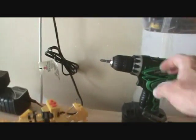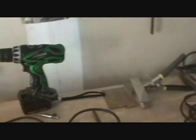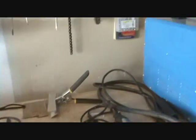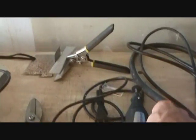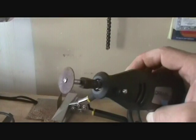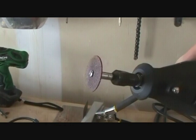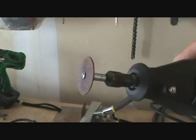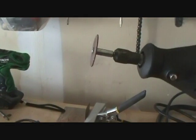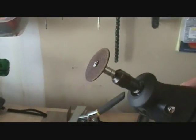The next tool is a drill — you're going to need a drill for quite a few holes and a lot of screwing. The next tool I used quite a bit was the Dremel tool, a simple little one, nothing fancy. I used these cut-off wheels quite a bit and went through packages of them. You really got to be careful with these — they tend to shatter if they get bound up and they'll go flying, so make sure you always wear your safety gear.